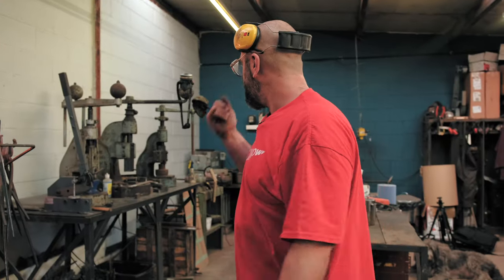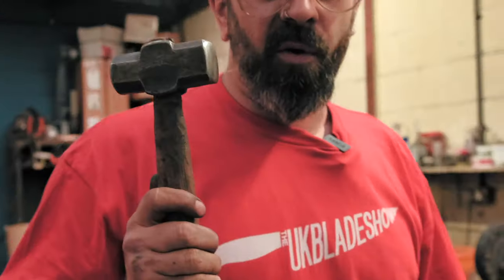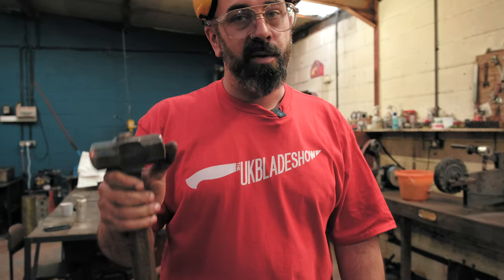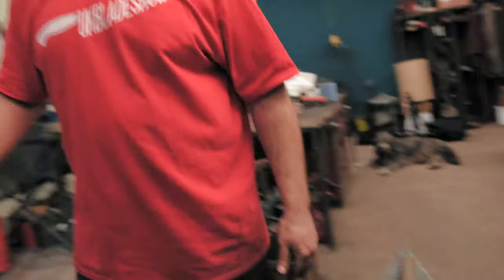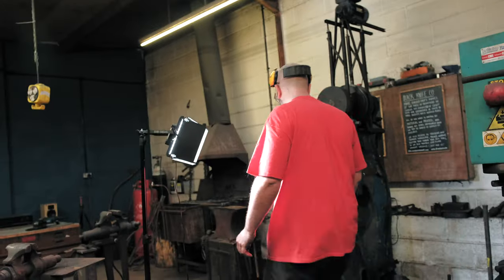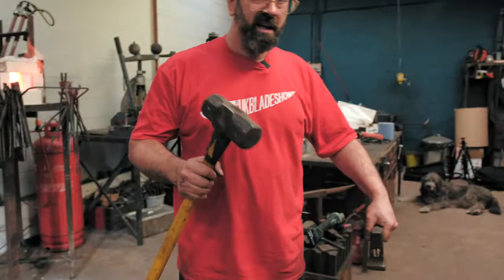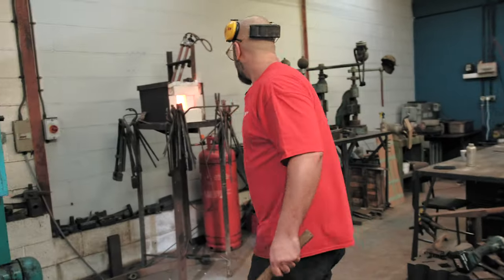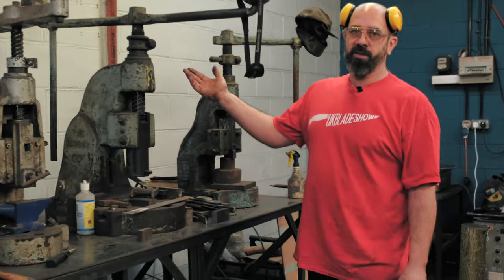You don't need a power hammer to do all of this — you could do it all with a hammer if you were a bit masochistic. You could use your mate with a sledgehammer and a flatter, get other bits of tooling in — something like that will do exactly the same job, only you've got to get someone else to swing it. If you try and swing the sledgehammer, hold onto it, and hang onto a bit of metal at the same time, that's going to go horribly wrong. Or a fly press — everything that Bertha does, you can do with a fly press.